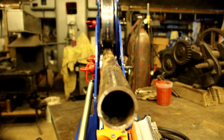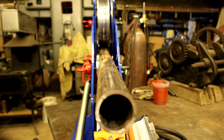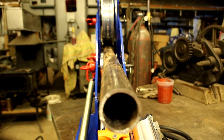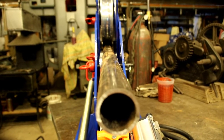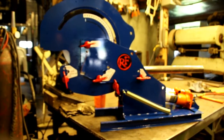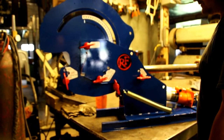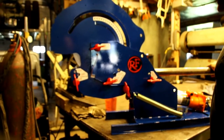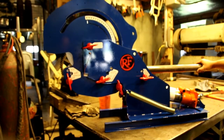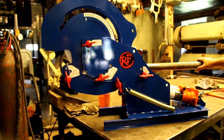Got a sample piece of two inch tubing in there with both pressure dies in there, as you can see. It's set up in the machine and we're going to turn it on. I think we can pull a 90 on this without any interference, but we'll check it as we go and see how it turns out. This is pretty heavy stuff — this is the largest tube you could bend in this machine, so it's going to go kind of slow. If you're bending three quarter or half inch or one inch stuff it goes extremely fast, but on the two inch it's going to be kind of slow.